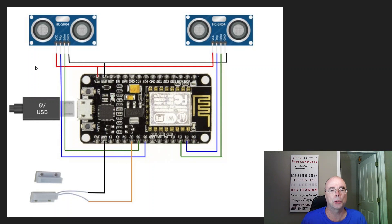Here's the wiring schematic — it's pretty straightforward. Both HC-SR04 ultrasonic sensors receive 5-volt and ground from the NodeMCU, and each has a trigger and an echo pin connected to a GPIO pin. The sensor sends out a pulse and measures the time it takes to return to determine distance. This is powered off 5-volt USB from the AC outlet on the garage. ESPHome is used as the code for this. Down at the bottom is the completely optional reed switch connection to the garage door so we know if it's opened or closed.